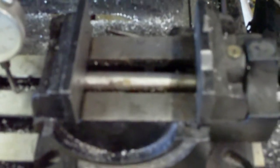This thing seems to be out from side to side. Now, that same YouTuber had suggested that I take a known square piece of stock, clamp it to the bed, flip the milling vise over, clamp it to the block, presumably so this was flat against it, and then square up the base.